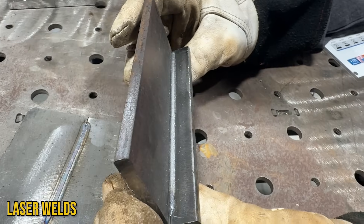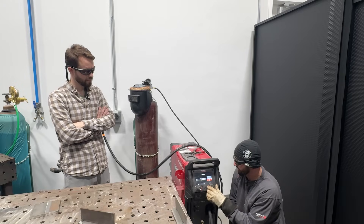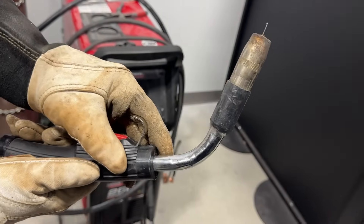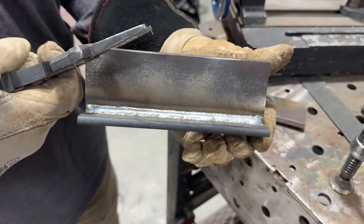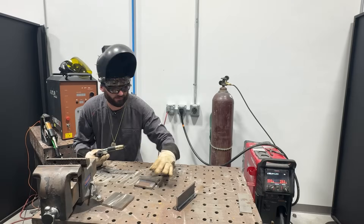Remember guys, we are going to do a cross-sectional etch for you all because that's what you want to see — everybody on the internet always wants to see a weld cross-section, and we will deliver. Now as promised we're going to be comparing this laser to MIG welding again. Rex and I both agree it's comparing apples to oranges — laser welding is better compared to TIG welding, where MIG welding is really relying heavily on the amount of reinforcement applied to the actual size of the fillet weld. We're going to set this Lincoln PowerMIG 260 up to the material thickness to accomplish the fillet weld, then turn things way up on both voltage and wire feed for the butt weld to get even deeper penetration into this three-eighths piece of plate on both sides.